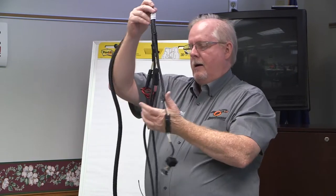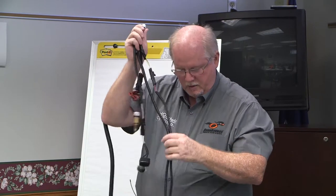You're right — we will have to replace the harness on it. What we'll do in that case is provide just a simple four-pin overlay harness that you can bundle with this one. We could probably use two wires out of the existing harness and just add two more wires in a small overlay harness to go with that proximity switch sensor. So that's the body-up switch covered.